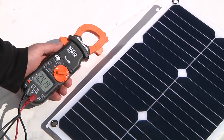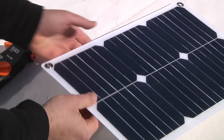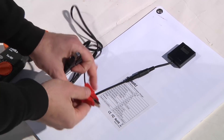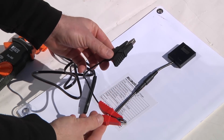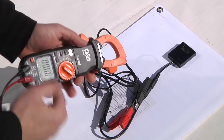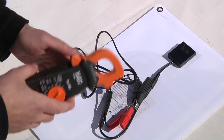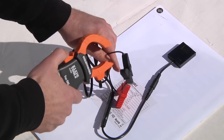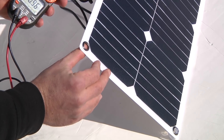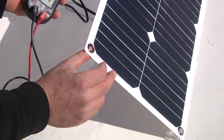Next, I'm going to measure current. I'll switch to a different setting on the meter and use the clamp feature. In this case we're actually going to short-circuit the solar panel — normally you would never short-circuit anything electrical, but you can do that specifically with photovoltaic solar panels. Connecting the leads together, measuring DC current with the clamp going around only one of the two wires, and holding it straight up in bright sun, I'm getting 0.90, 0.94, 0.95 — just a little less than one amp.